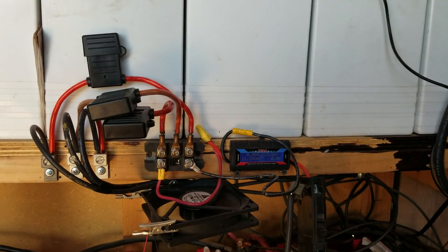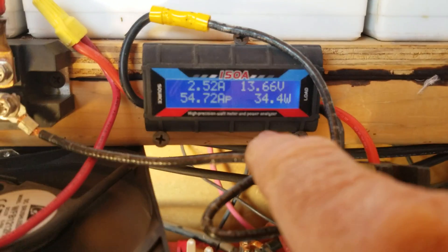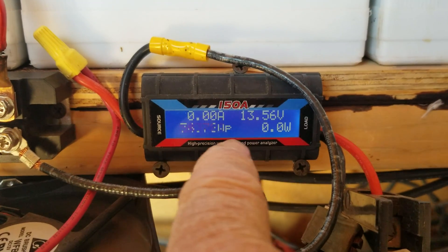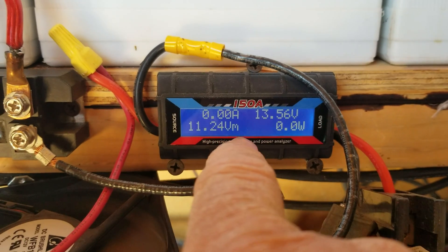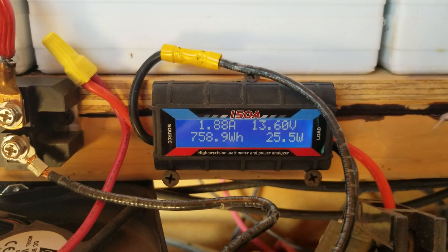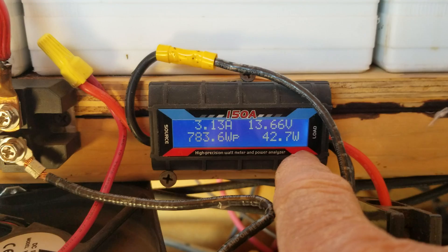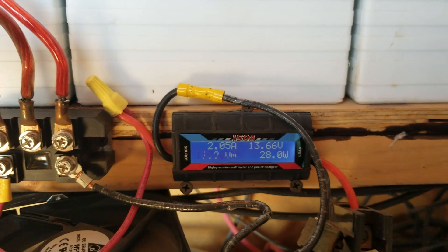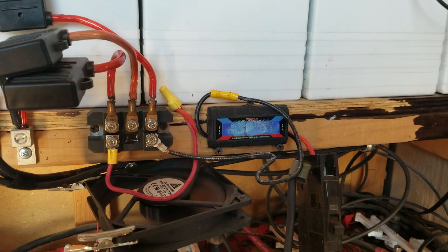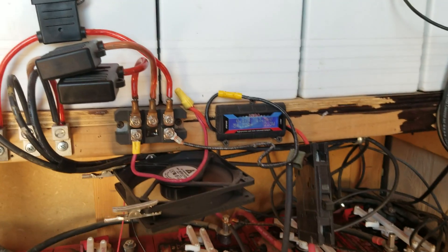It's good for winds up to 90 miles per hour and that's 1,865 watts. What we're looking at here is my cheap 150-amp Chinese-made meter tied in. You can see it's running through AP, WP is watts peak, that's amp hours, volts max, watts, amps peak, watts peak, and so on. Right now I'm only taking in 2.5 to 1.8 amps and 32 to 42 watts because the wind has just calmed down. A few seconds ago this was up by 300 watts. The peak watts reading is 783, so that's pretty close to eight 100-watt panels. Winds have not gone over 25–26 miles per hour.